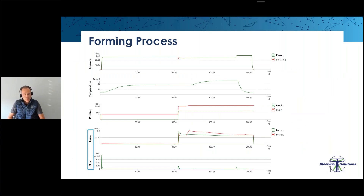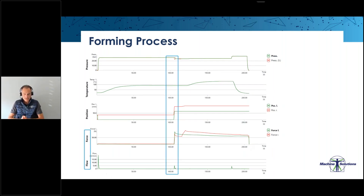On BWTEC equipment we have the option for flow feedback and force feedback. The flow feedback shows how much air flow is in the tube and is an additional indicator of balloon forming — especially important and useful in the R&D phase but also on the production floor. The force measurement records the force on the extrusion during the process and provides important feedback for optimal process development. The pressure drop, pulling, force, and flow all occurring at the same time is a good indicator that a balloon is forming.